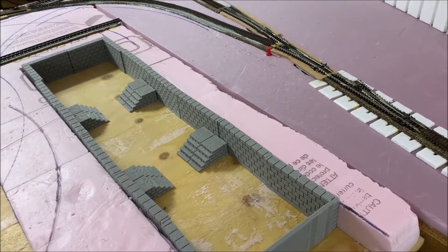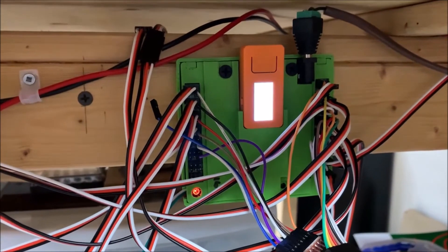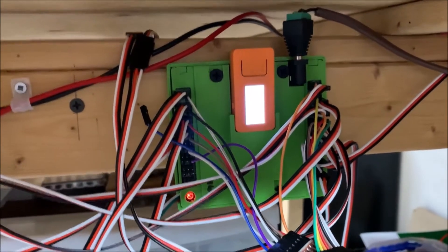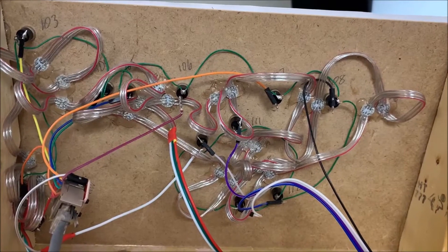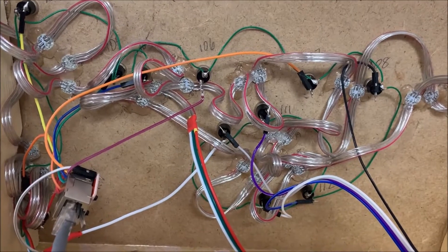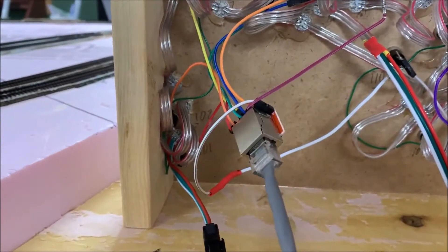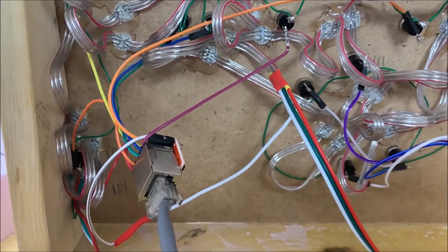Over here I just have some more — that area will be for a dry dock eventually. Underneath the layout I have a whole mess of wires because I haven't cleaned it up yet, but you can see the green hat here with the IoTT stick, and it's basically controlling all of the switches in this particular area. On the back of my control panel you can see how the LED string is applied to the back — I use hot glue to cement the LEDs in place. The push buttons are all connected via a couple of Cat5 cables which go to the green hat, making it a little more convenient to work on.